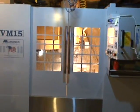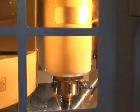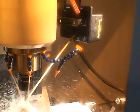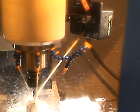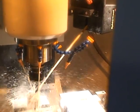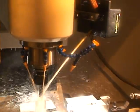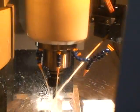Hello everybody. I have my Miltronics VM15 set up with a SpiderCool. I thought I'd give you a quick video showing you it working. It's connected to the head of the machine and it points at the tool. You can adjust it for however long your tool is or however long your tool holder is. It's got a couple different modes it works in and it remembers its setting for each tool. In my case I have a 20 tool carousel and it's remembering settings for 20 tools.